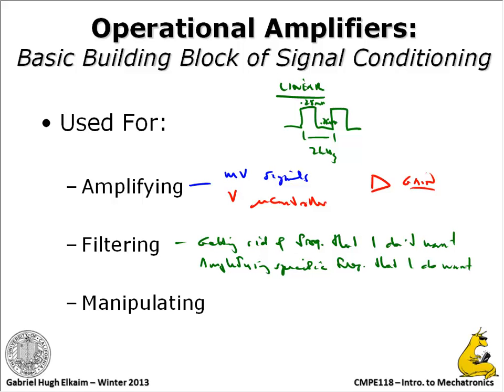All right, so now, a square wave, unfortunately, contains all frequencies, right? Now it's not a perfectly square wave. If you look at it, it's got rounded corners on it, so it doesn't go up into the terahertz range. But it's got a lot of higher frequencies on there that you're going to want to get rid of. Likewise, it's got lower frequencies. But underneath this, the 2 kilohertz modulation means that fundamentally I want to isolate that 2 kilohertz signal and see if it's there. All right? And so what I want to do is get rid of everything that isn't 2 kilohertz.